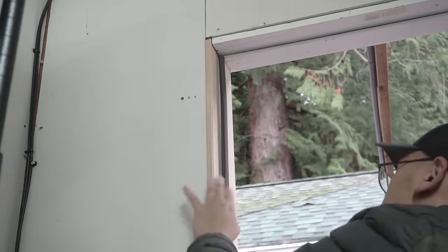The same thing we're going to do with the deadbolt plate. This one goes all the way deep because it has a longer arm that goes through there. Just repeat the process as you did with the door strike. I'm using my chisel for this one and not the oscillating tool because it's right in the middle.